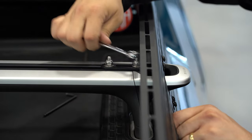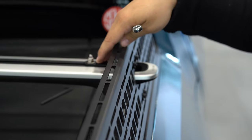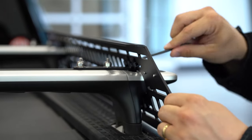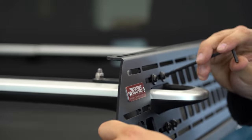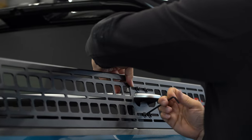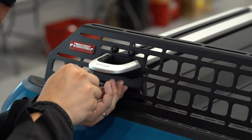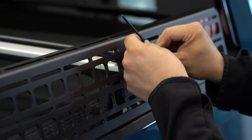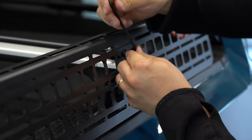I'm going to start by tightening down the support brackets to get the depth of the panel correct — just snug is fine there. I'm going to do that on the front before moving to the rear. So I've got my support bracket snug. Now I'm just moving the panel front to back. I can also lift it up and down just slightly in order to get it aligned so that it's not contacting either of the crossbars. Once those are snug, I'm just going to get on the longer side of this Allen wrench and give it another eighth of a turn or so — just to tighten it up — and we won't have any problems.